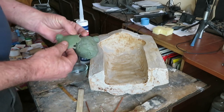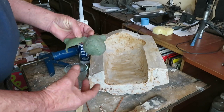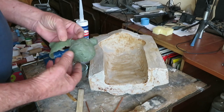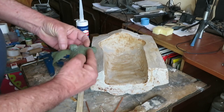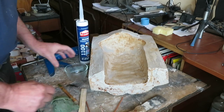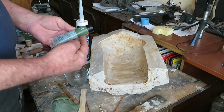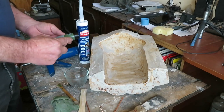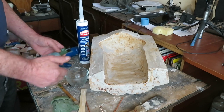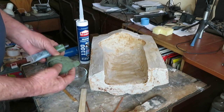The colour or shade has to be consistent — we can't have one shade of green here and another shade there, because we would have a clown frog. We have to ensure an even colour all over the frog. Therefore, we will mix the same amount of silicone with the same amount of acrylic paint every time, measuring the bead of paint against the silicone when we prepare the mix, and repeating that measurement over and over so we always get the same shade of green.